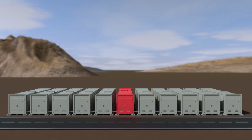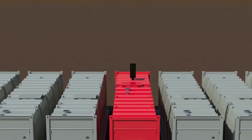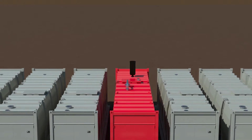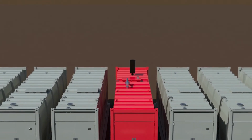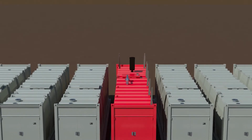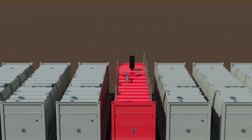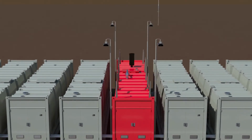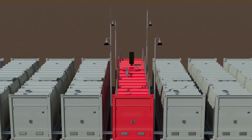The containers are standing in position. Now the assembly of the external tank equipment follows. Air filters for ventilation and airing, electronic substance display per tank chamber and a motorized ball valve in the suction pipe of the container. Railing units for mounting an all-round security area, lamps for localized lighting and lightning arrestor.